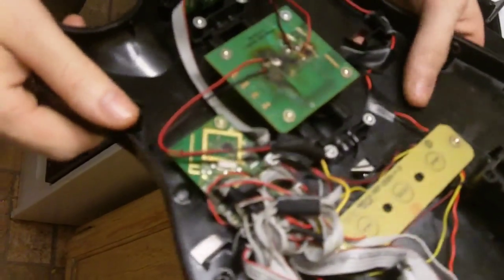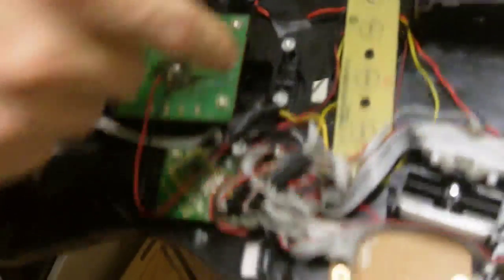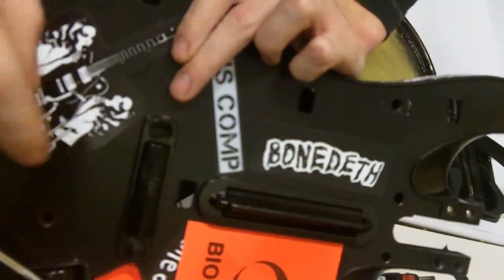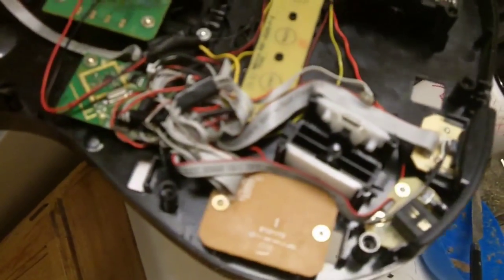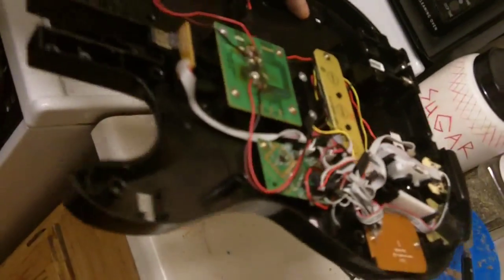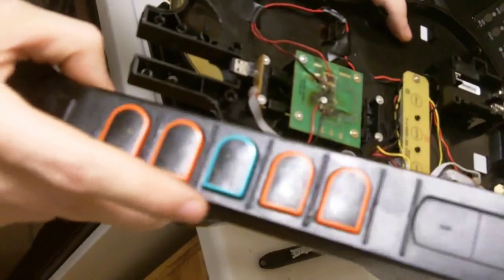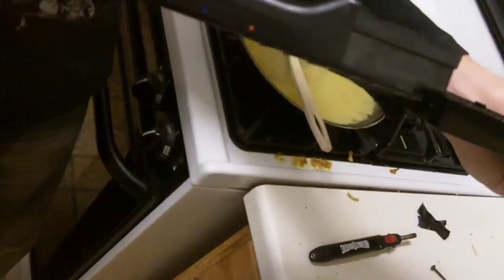I'll go over my own guitar setup real quick. I've re-soldered this a million times. I got the up and down wires changed out completely. I've got a World Tour strum in there because my other strum broke — it snapped on the inside. I removed one of my start buttons because when I strummed down with my elbow I was always hitting it. I've got a World Tour whammy and a World Tour toggle, which is what this mess is from because it's not supposed to be wired this way at all — it took forever to figure out. It's pretty messy, but even after your guitar's long dead, it still works. The only other thing I do is take out the yellow key or scrape off the bump on it. And I play with wax — don't do that, it will mess up your guitar.